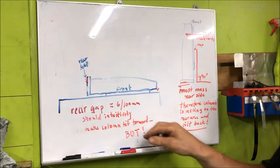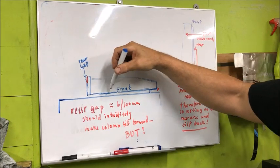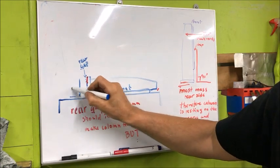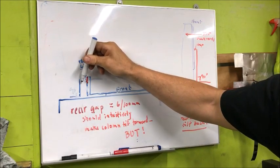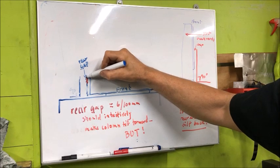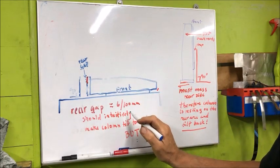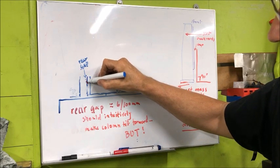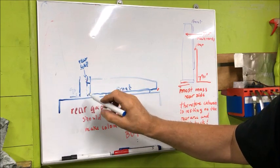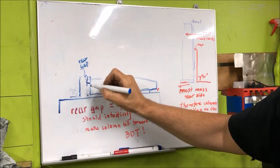I'll try to explain what I think is happening. Referring to the measurement where I put the front face down to the plate and measure with a square here — this is 90 degrees, and then the side here pronounced a gap. If I had a four hundredths shim there, I could easily fit a ten hundredths shim there. So the gap here was about six hundredths of a millimeter. That was down to almost here — the rest would contact and be at the same 90 degrees to the front, the same plane as it should be.